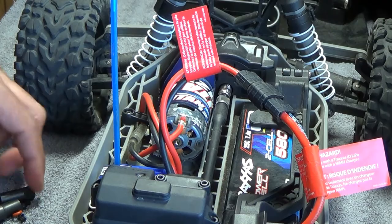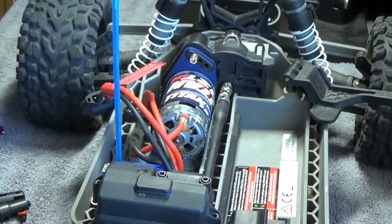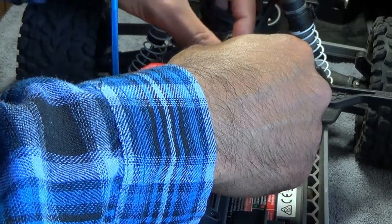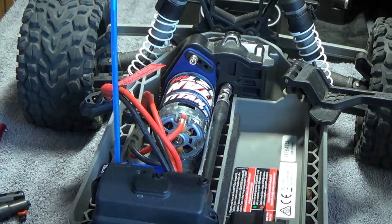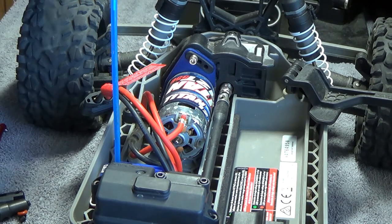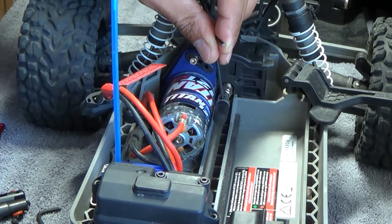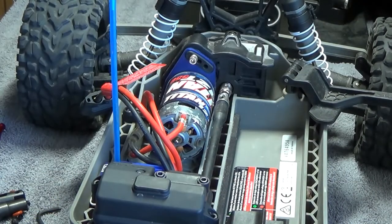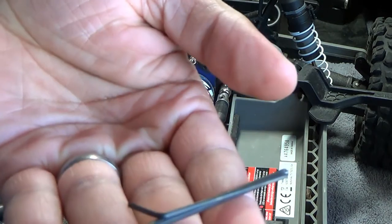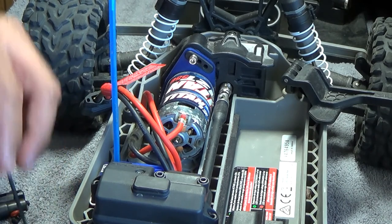What I end up doing is repairing, upgrading, and fixing, so I figured this would be a good time to get this on camera. Back to getting the grub screw out. FYI, always try and use the right Allen wrench — if there's any play, try another. If it's too small or too big, try the next size, and make sure you're not putting it in at an angle.